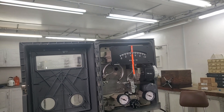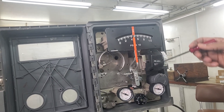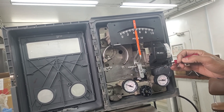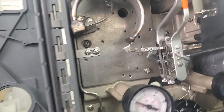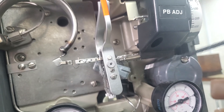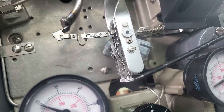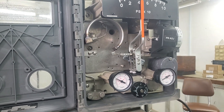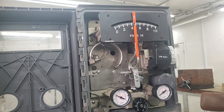This confirms the calibration is good. If it is not within calibration, you need to adjust the pointer to read from 0 to 100. The zero adjustment is done by loosening the lock nut and turning this screw. To adjust the span, if it reads high or low at full scale, you adjust from the span screw.